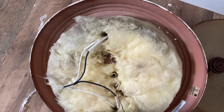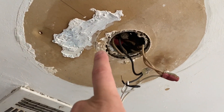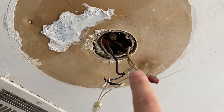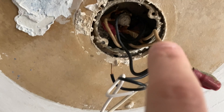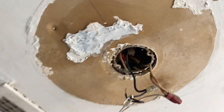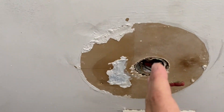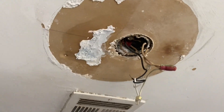I'll show you how I'm going to do that. I'm basically going to poke around this area with a tiny nail and a hammer, poking around until I find the wood. You can also look up through the gaps and cracks to find the wood that way. Once you find it, it'll be running either this way or that way, and you want to nail the metal bracket into that wood so it cannot fall off.